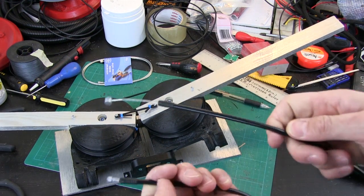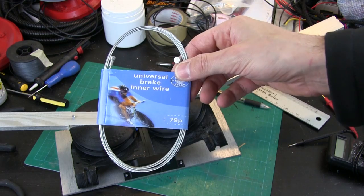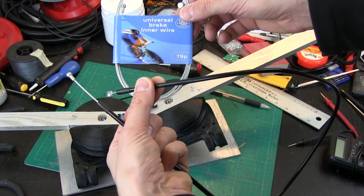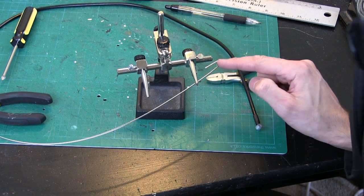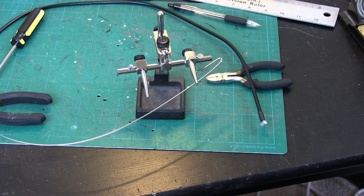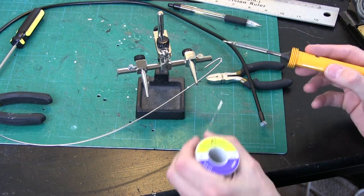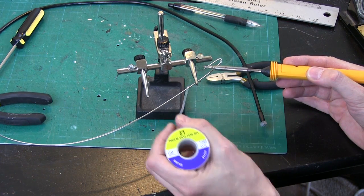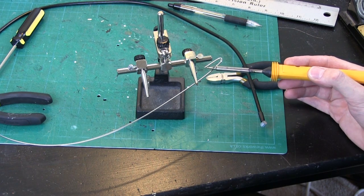Unfortunately there isn't enough travel in the existing cable to actually pull the pulley, so I've got another brake cord — the type without the outer sleeve — and I'm going to cut the short one out and put in a longer one. I've cut out the shorter cables and put a crimp on the end. The steel cable is basically wrapped around itself, and to stop it fraying you can get a little cap from a bicycle accessory shop, but I'm just going to solder the end with a tiny bit of solder to stop the ends coming apart and any spiky bits poking out.